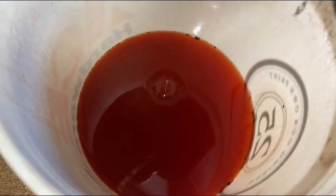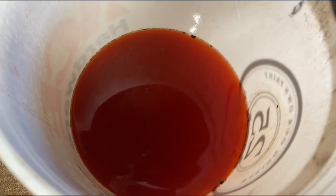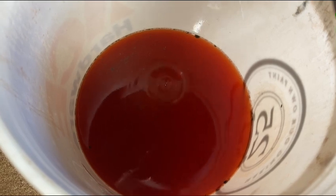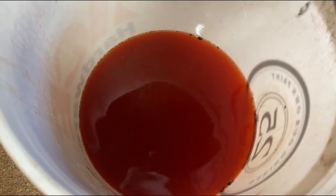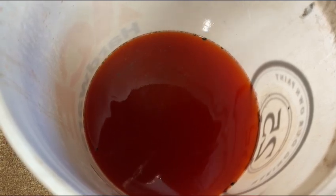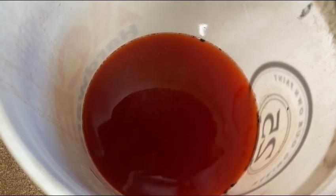So I checked the forums on Yesterday's Tractors and a couple other sites. And it makes sense to me. This block could have frozen. There could be a crack in the oil galley. Also, this thing is an oil burner, so it could be blow-by from the crankcase coupled with a blown head gasket, forcing oil into the radiator. Be that as it may, I'm still going to pull the head off and do a further inspection.